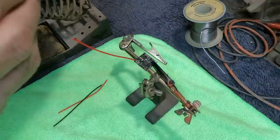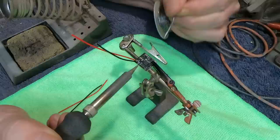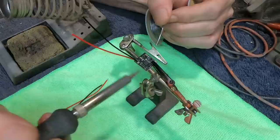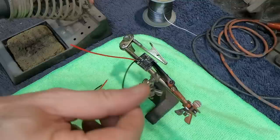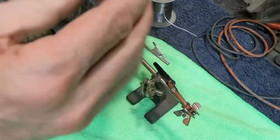Okay, so we'll go to the black one now. Since this wire already had a little bit of solder on the end, that solder also melted, so we bonded it all the way through the wire — that's exactly what we want. We're going to do the same thing on this side. Just a quick little touch like that, and you always want to make sure the solder hasn't pulled and leaked over onto the other connection. You want to make sure there's a space in between those — and we're looking good here.